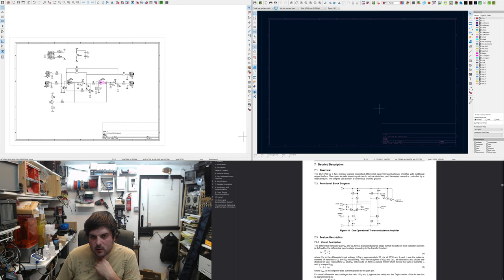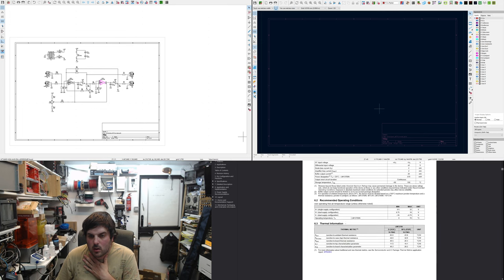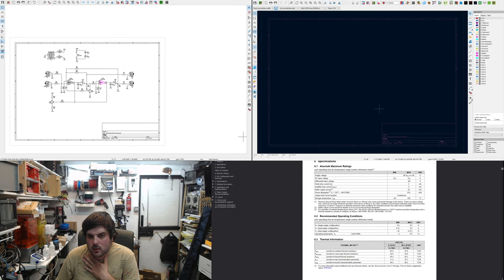Internal schematic again. Yeah, it's fine. You're never going to, if you put it down to -12, you're reverse biasing. You wouldn't even be reverse biasing it because they're already biased to -12. You might blow it up if you did more than -12. That's not likely at all in Eurorack. Let's double check the absolute max supply voltage. Yeah, so the DC input voltage can be anywhere between the rails. The differential voltage maximum is 5 volts. We're way below that because we're dividing it by about 1/100th.